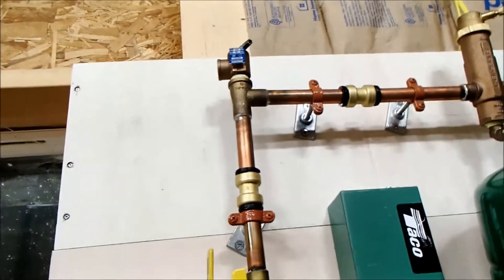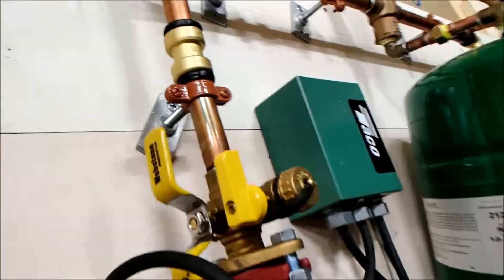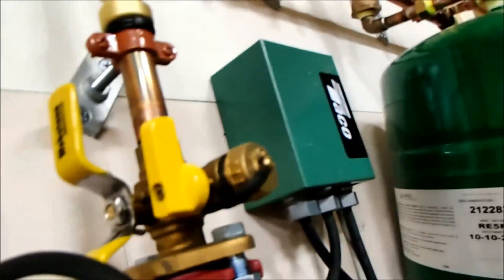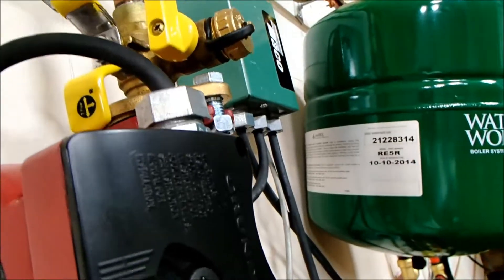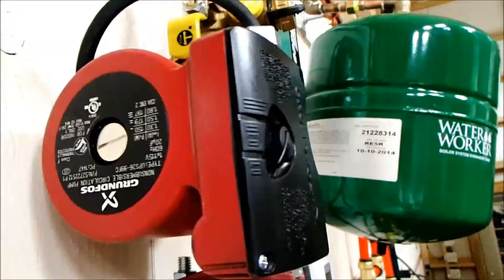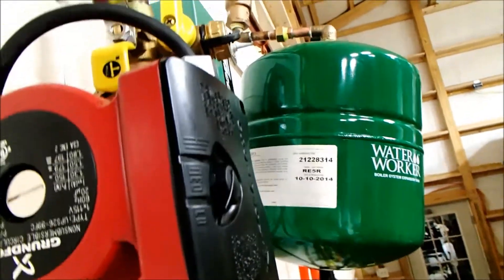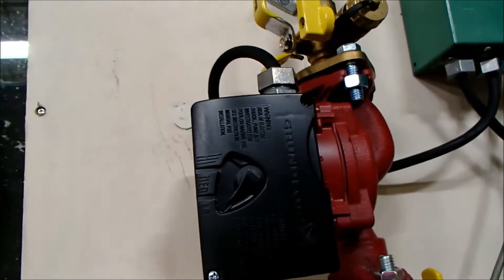Going over, there's a pressure relief valve at the top, then it comes down to an isolator service valve that allows you to remove or add fluid into the system. It's on a rotating pump flange connected to the Grundfos circulator pump — this is my primary pump. These pumps are the UPS 26-99 FC, rated at 1/6 horsepower with a range of 0 to 33 gallons per minute and three speed settings. I got a pretty good deal on them on eBay and used that model for both my primary and secondary pump.